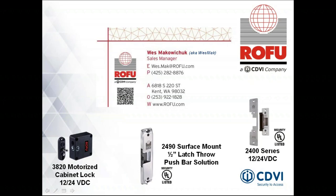This is the most popular one. The reason is that it's a surface mount. You don't have to cut out any of the metal frame on your door to install this lock, so it's a very easy, very convenient, very quick install. This particular model, the 2490, has a half-inch latch throw from your bar. We also have a three-quarter-inch latch throw available that is also surface mount. And if you have existing doors, we also have ones that you can install that are not surface mount.